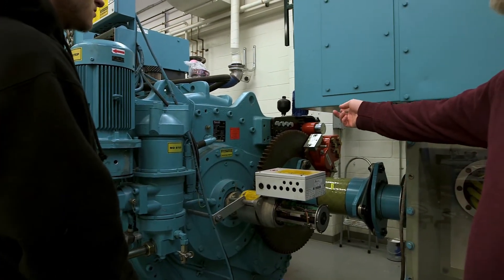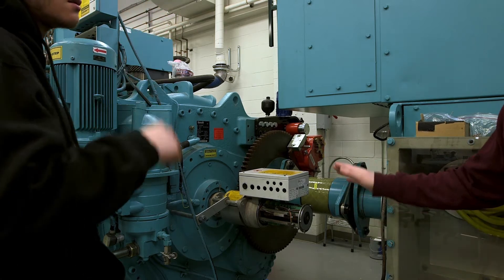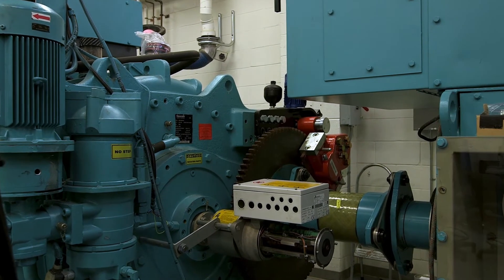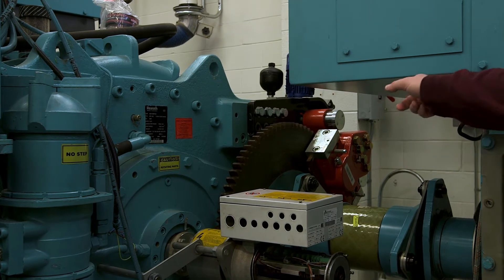This is the brake here. This is not the main way they brake the turbines. In order to stop the turbines, they pitch the blades — they turn the blades to 90 degrees and that stops the turbine. This brake is like a parking brake, and they do use it in an emergency situation. It's just like a disc brake you'd find in a car.